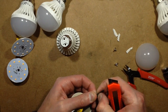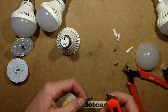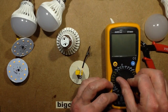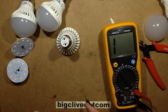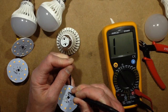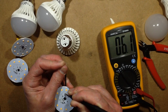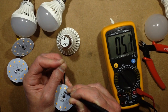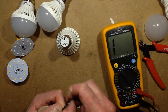Let's see if this one has the choke or the resistor — I'll just slip it open. This one has a resistor. I'll try and measure it — it's going to be a low value, I think it's really just being used as a fuse. I'll aim for the 200 ohm range. Clamping one wire and putting the other onto it — it reads 5.6 ohms. 5.6 is a standard value, so it's really just a metal film resistor being used as a fuse.